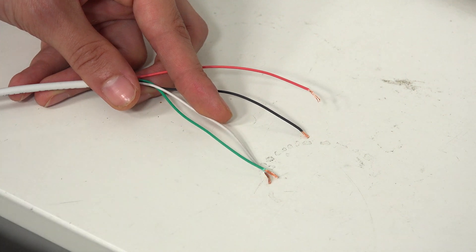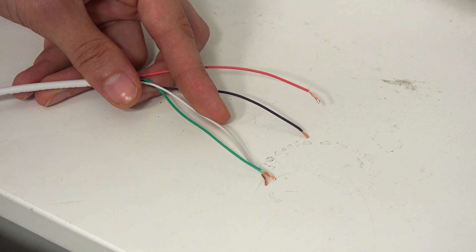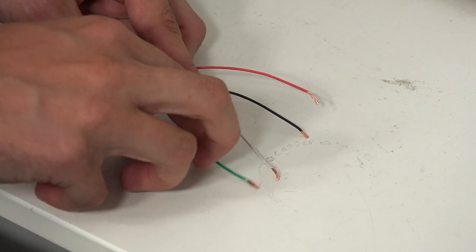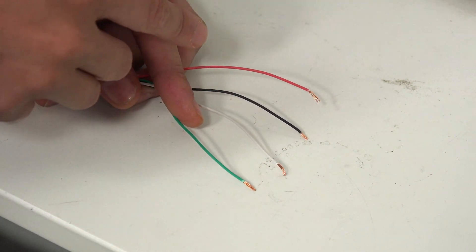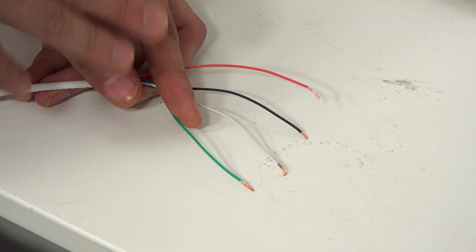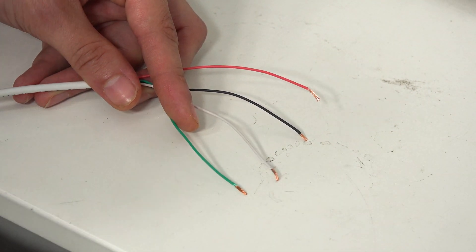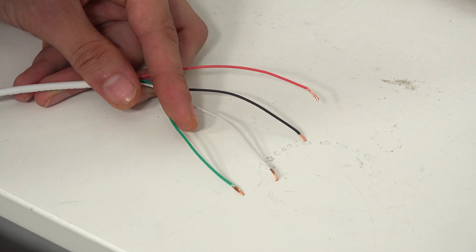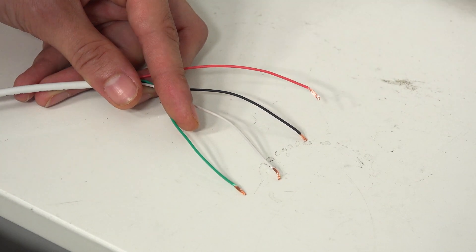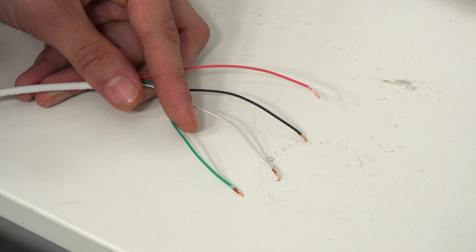If you're going over the power budget, you will need to add an external power supply. It's a four-wire connection — we're using 22-gauge four-conductor wire, though 18-gauge also works fine, really whatever you have around. We like to make our wire color-coded so we know where everything goes, but color isn't super important as long as the wires match at the communicator and the panel.